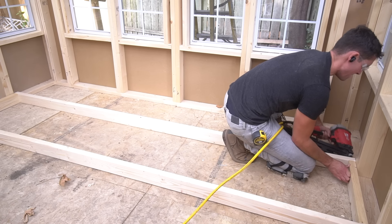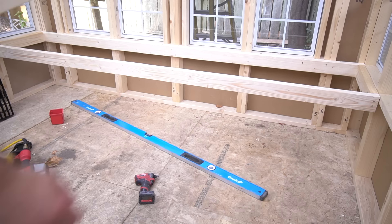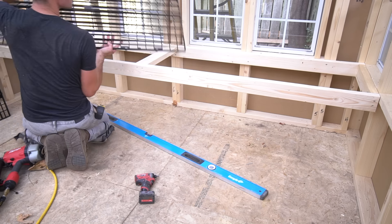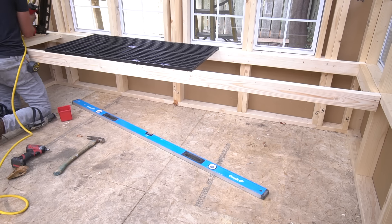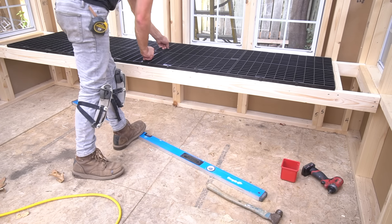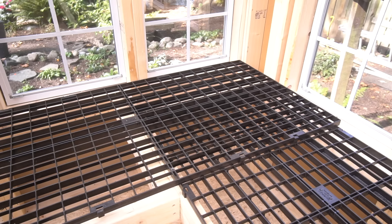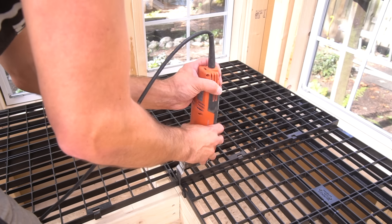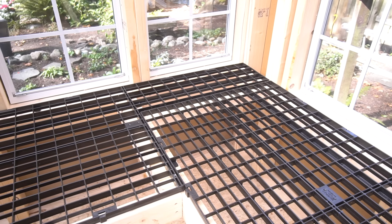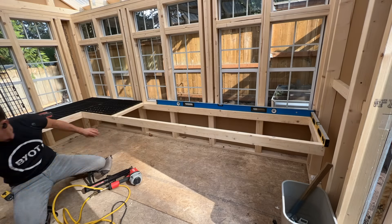We can then move on to shelving. This unit also comes with its own shelving system, which is just 2x4s that also come with specialty grates to fit the space. I align this framing right underneath our windowsill because I still want full access to our windows — each one of these windows does open up for a nice cross flow breeze. Each shelf consists of two pieces that are 113 inches long and the side smaller pieces are 21 inches long. The plastic grate systems are actually extremely easy to cut — I just take my multi-tool to cut down the sections needed. The really nice thing about this pattern is that you can cut basically at any point and the shelf itself is still very structurally sound because of this rectangular honeycomb pattern within each shelf.